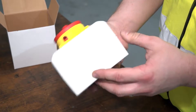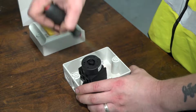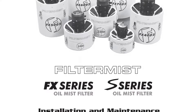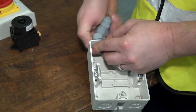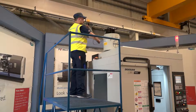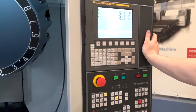Using an isolator allows the filter mist unit to be classed as a machine according to the Machine Directive 2006/42/EC. Please refer to the installation manual for recommended overload settings and terminal connections. Punch out the gland holes and fit the glands. Attach the back box to the machine tool and screw the cover plate onto the isolator. Power supply must be connected by a qualified electrician.